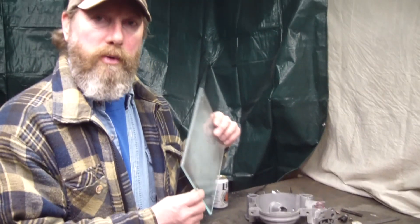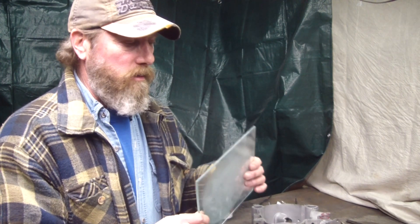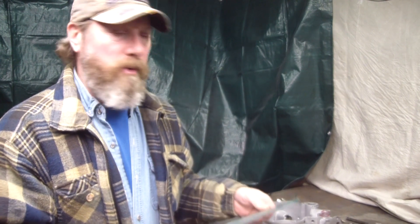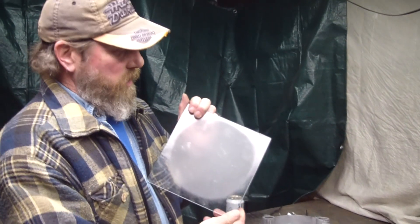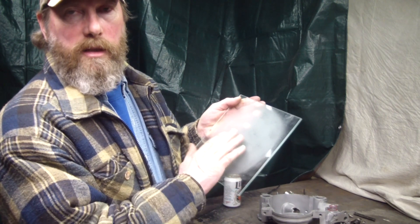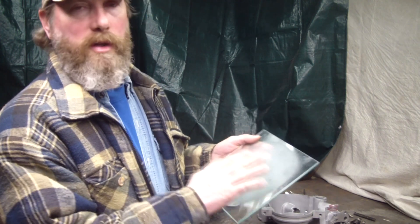The glass being used is called plate glass. He got this tip from someone on the internet who recommended going to a hardware store and getting a section of broken glass very cheap. Don't try to use other types of glass, especially automotive glass — it's tempered, and if you bump it or put pressure on it when it's not on an even surface, it'll shatter. Plate glass is more durable, or you can use an old mirror. The lapping compound itself is wearing into and etching the glass, so the owner suggests using emery cloth to keep it more true.